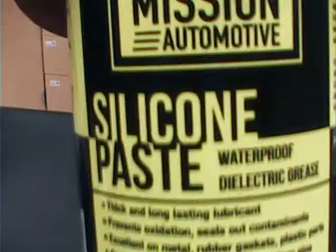I started with mineral oil but found I do very well with this Mission Automotive silicone paste — it's a polydimethylsiloxane. Make sure you wear gloves. You take some of that paste and blend it with the manganese dioxide and carbon. It coats beautifully on graphite electrodes. With gloves on you can fashion it right around the graphite electrode, uniformly coat it, and it holds up beautifully.